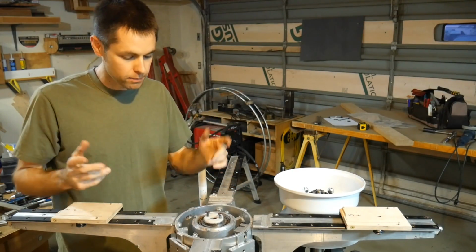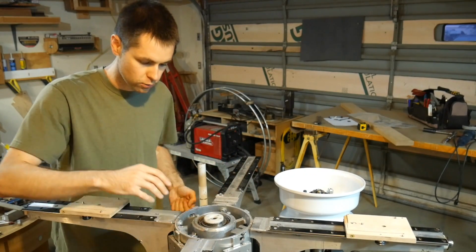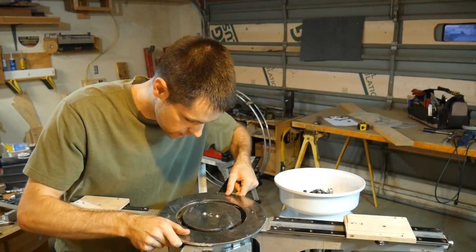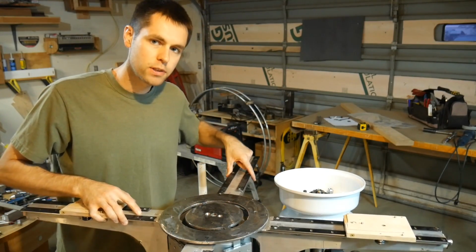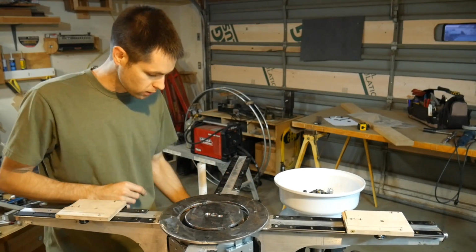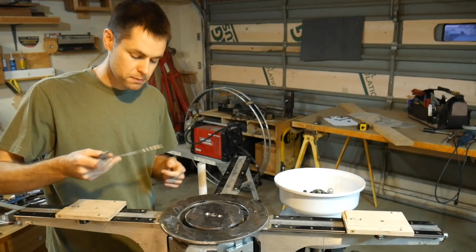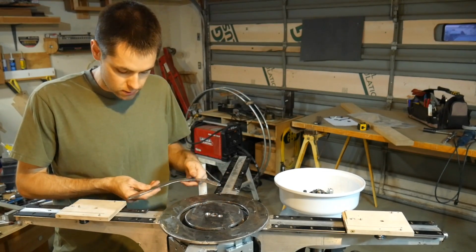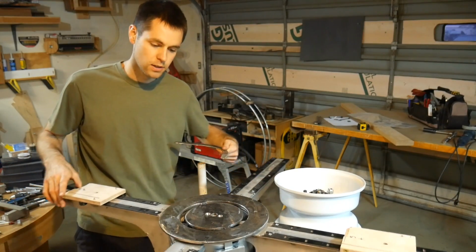I want to talk more about this expansion mechanism because this is what has been occupying most of my free mental capacity lately. So this hub here does the rotation, and that's great. What we need is a stationary piece in the center that does not move with the hub, because the arms are moving. By these arms, I mean. And then the expansion arms attach to this, and when this goes around, it forces the cart out, okay?